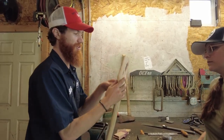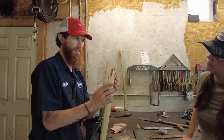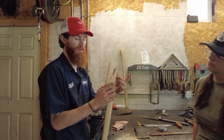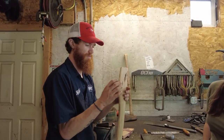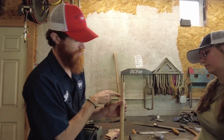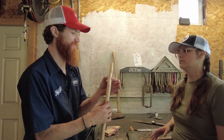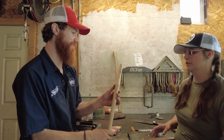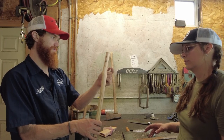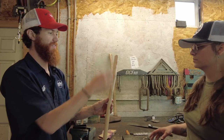Yeah, so if it's coming off the front, if the handle's digging in the front, you pull off the back, and then when it sets down, you're obviously gonna have some curling around the outside. But you can see where it's rubbing here on the back. So it's being pushed, it's being pinched. And obviously this is curling because it's thin, versus it's not gonna curl in the back because it's thick. I would just knock this off a little bit, just to keep that curl from accidentally walking its way down the handle, and then come into the back and we'll go from there.